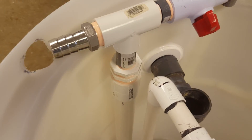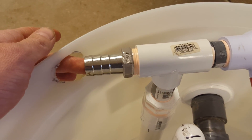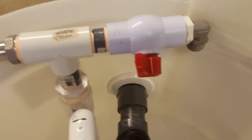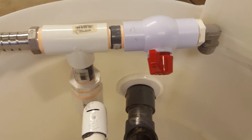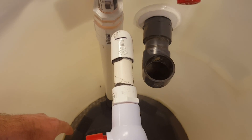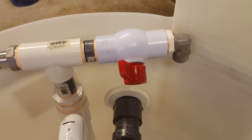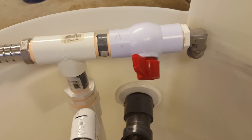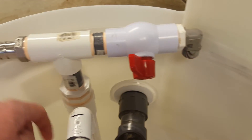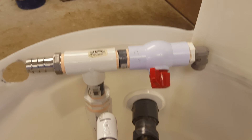My aquaponic system uses a small pressure, small volume water pump. This hole here will be the inlet for my braided water line onto a stainless steel fitting to a T, and that water will be going down the large pipe and distributed through the base. I got thinking that if the power ever fails or the pump ever fails, the pump has the potential to siphon all the dirty water out of the base and back out to my aquaponic troughs. So if I put this ball valve on and have a slow trickle of water coming out of that 90 on the end, if the electricity is shut off by accident, the pump will suck the air from this before it will suck the water out of the tank. Therefore, I do not have all this filthy water going back into my system — it's kind of a cheap man's anti-siphoning valve.